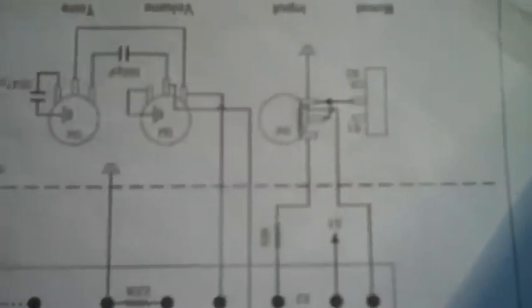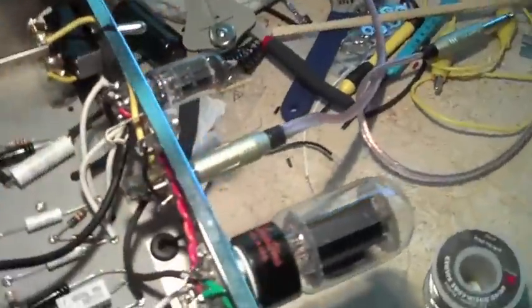It doesn't say anything in the book about this particular wire. I should have known, because I know how the jacks work — when you unplug your guitar, there's a contact in there that grounds out the jack so you don't get hum. That wire is on the schematic but the book doesn't say anything about putting that wire there. So I put that wire — you can see it's just that added yellow wire right here.